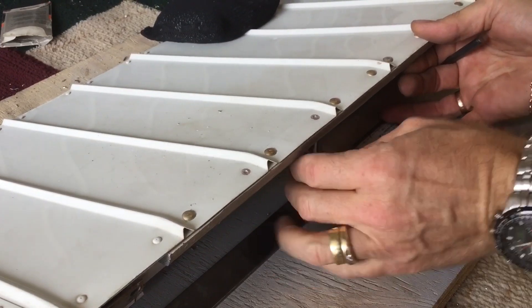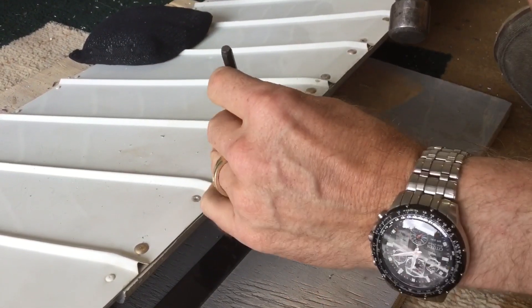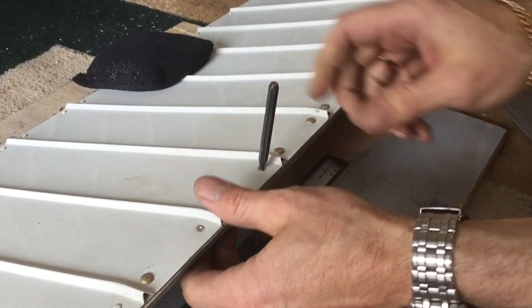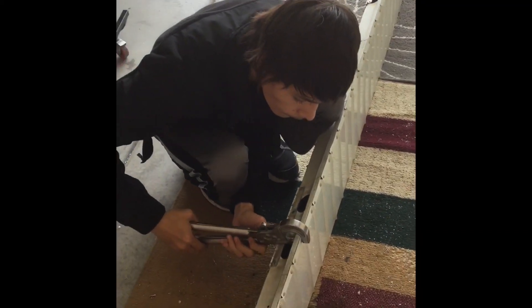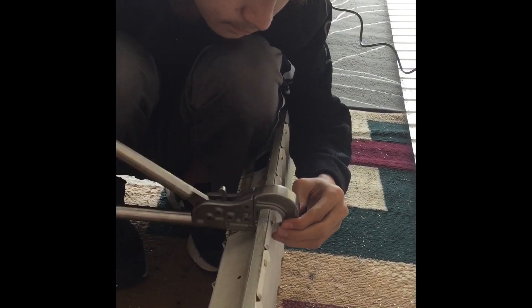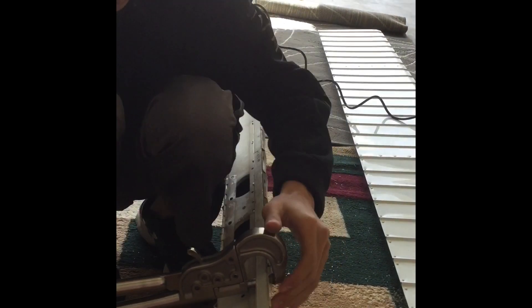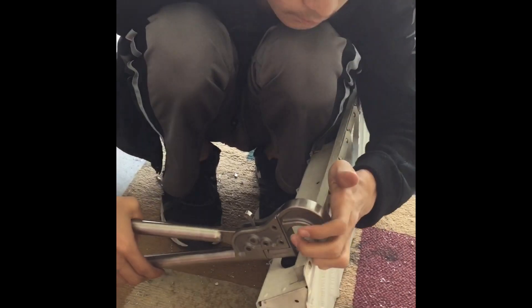I'll put this socket on the bottom side to support the metal around the shop head. The head's already been drilled off — we'll use a smaller punch. There's one of the old rivets. What JJ is doing here is, because of the way these rivets sit in that balance weight, the heads don't sit super flush. Jay's using the actual squeezer with the anvil die on one side and the open ram on the other to push those rivets down and make sure the heads sit flush. Then we'll switch it out, put the actual anvil on the ram, and set those rivets permanently.